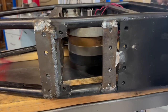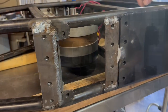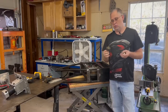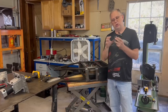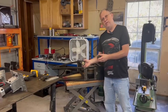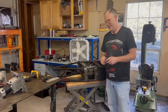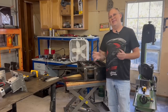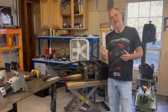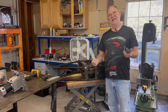Time to throw a motor in there and make sure everything clears. The typical drivetrain mount uses shock isolators to give some cushion to the drive, plus solid bolts in the middle so even if these break it doesn't go anywhere - this has worked really well. Moving it forward, I thought I'd have room because of extra clearance on the weapon motor, but it turned out not quite enough space. I had to machine up some spacers to move it out just a little bit to have enough room for everything to clear.